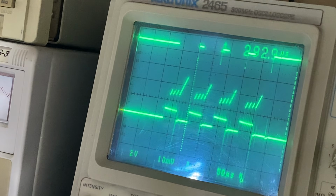But maybe there is a way you can snubber that down a little bit. It's just as it turns off, the inductor's giving a bit more of a spike, dumping the energy, without getting hit with another cycle. So that's what's happening there. It's actually an inductive spike. That could be taken care of with an RC network, which is just a resistor and a capacitor in series, put across the inductor. And you may have to experiment to get that level down. So anyway, that's how you make a synchronous power supply for this. You don't need to go and put a power supply in. Just do that.